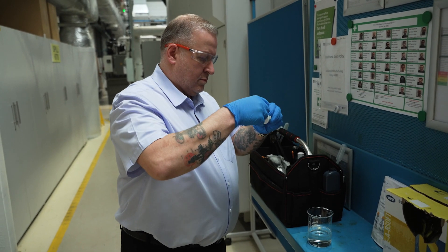If using stored water rather than direct mains, carry out weekly inspections of water storage tanks and water filtration equipment to ensure they're kept clean. If you think about it, water is the main thing going into your machine — it could be 90–95% of what you're machining with, so it needs to be good quality to start off with.